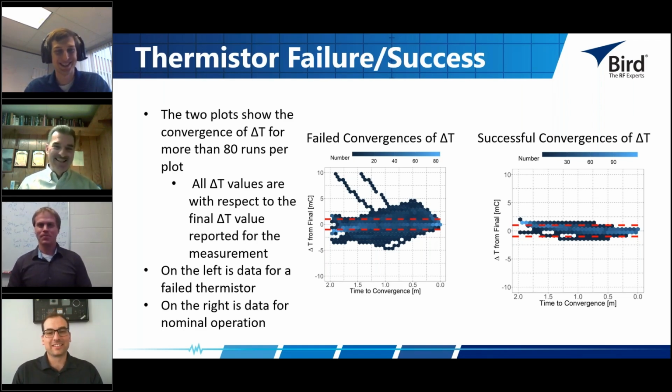Not a chance. But Jeff has developed the programming around this, and has made this convergence criteria with modern computing a thing that this thing does every day. It does every day, all day, and because of that, we are able to push the boundaries of how accurate a power measurement can be. And I mean, these are the things that we're caring about. We're caring about thousandths of a degree C in order to get this system where we want to, so we can build sensors that we can put in the field that are as accurate as possible.